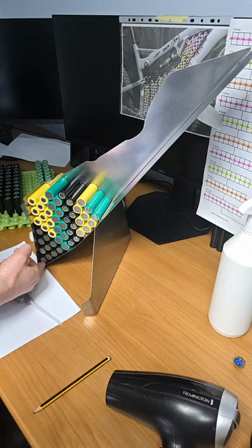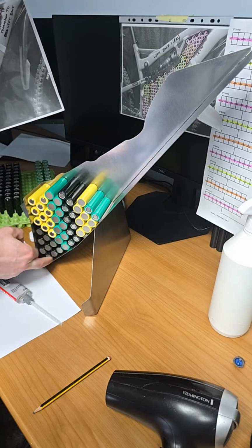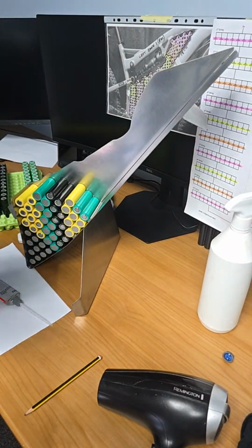So this is where the terminal will be taken off this pack, negative terminal. So negative poles facing out here on these 10 cells. So 10 cells in each group, 20 in series, gives us 72 volts, 84 volts maximum.